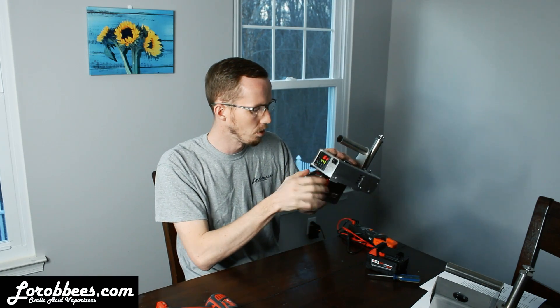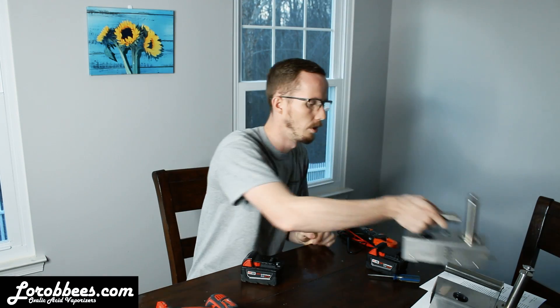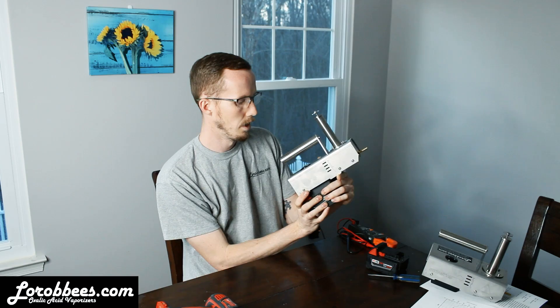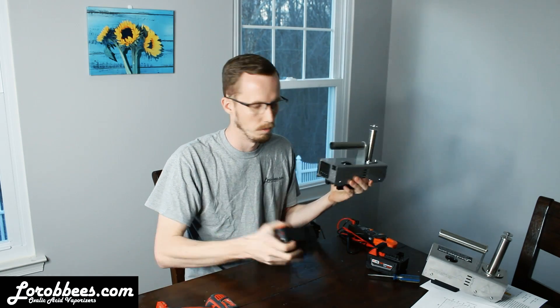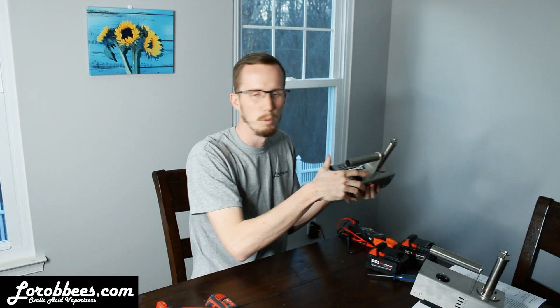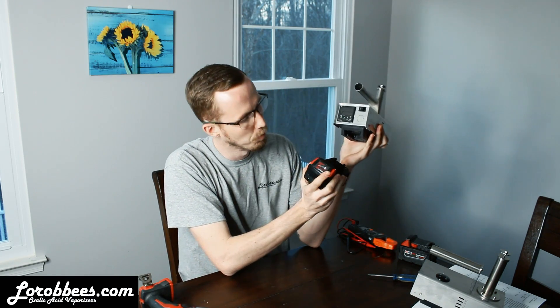You'll see that this turns on and boots up — our voltage is reading 19.8 volts, so that's just about a fully charged battery. We put it in the second unit: 19.8 again, it booted up correctly. So we've proven that both units work and are functional. Now we'll determine which one has battery protection built in, like the Milwaukee and DeWalt tools do, by using the dead battery that's blinking here.